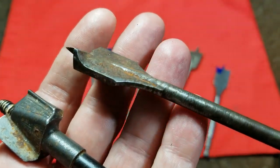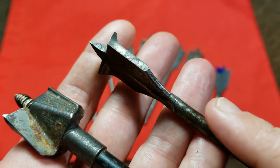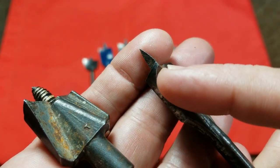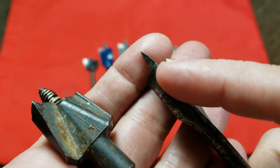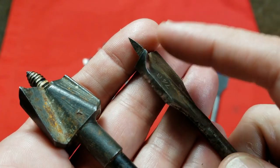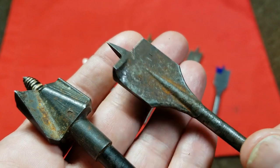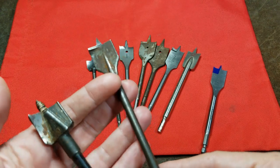This brand I do not know, but it's obviously been forged because you can see the forging markings here. This is obviously a much higher quality one — it's pretty thick, the tip is really thick. As far as rake, it actually has a design that's getting more towards what other types of wood-cutting bits like self-feed bits have, where it has this long leading area. This is actually really similar to many wood augers. They've integrated a much more complicated and thicker geometry. It's a heavier-duty type of bit and really is pretty high quality. We'll see how that cuts.